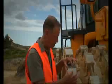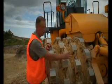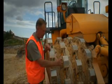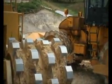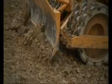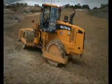With the CAT, with the narrow long feet and five rows, the gap in between each row is not compacted. With our offset and wider feet, the gap here is compacted by the following drum. Plus, with the CAT 825 we have 52 feet less per machine, and with the Hyundai 770 against the 815 there are 32 less feet — 32 less feet to push in and pull out of the material. Less bypass, less drag, less power required.